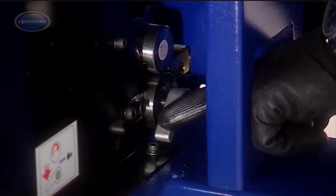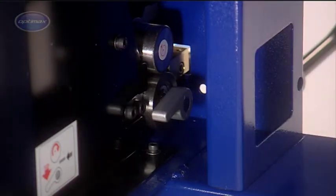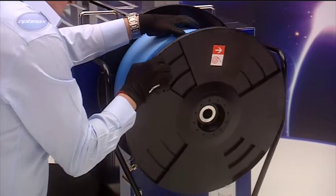When the reset button is pressed, the strap is automatically fed into the AFS-900. The benefit of this feature is that strap coils can be reloaded without moving the machine from the packing line.